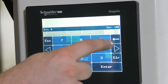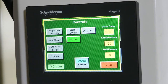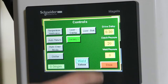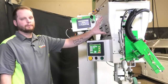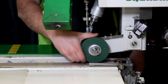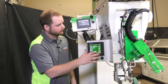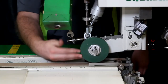Just like we were checking the weld pressure, we're going to go up gradually — I'm going to set this at 20. I have a little bit more resistance, which is a good sign. We're going to go up to 50, and again the higher that you go you're going to be able to hear it actuate inside the head carriage. Now it's a little bit more tough to spin here. Then let's go back to zero. You're going to be able to hear that bleed out a little bit and now we have little to no clutch pressure there.